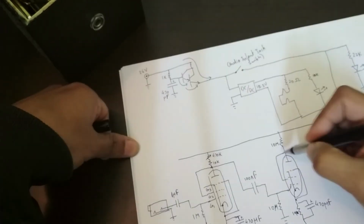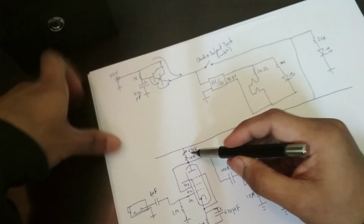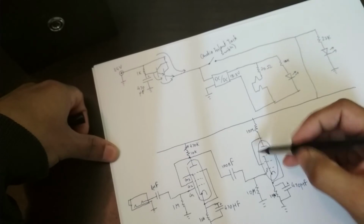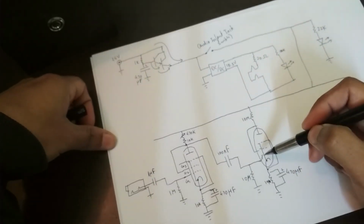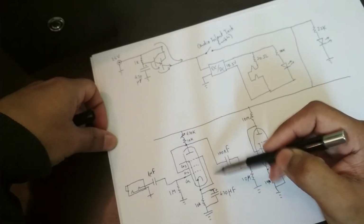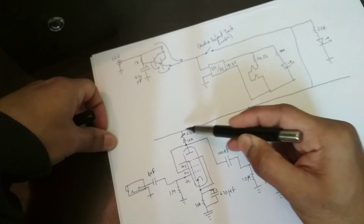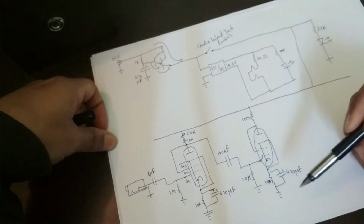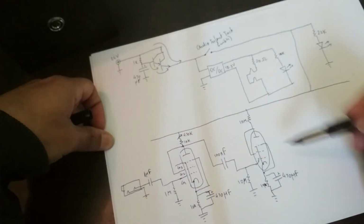And the reason that I can get away with this over here is that, if I used such a large value over there, that's not going to work out particularly well, because the input impedance of the next tube is not high enough to allow for such a high output impedance on this stage, right? Because this sets not just the gain, it also sets the output impedance, because that is the path through which the signal current is going to arrive.